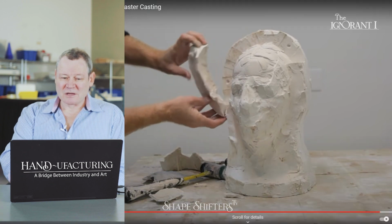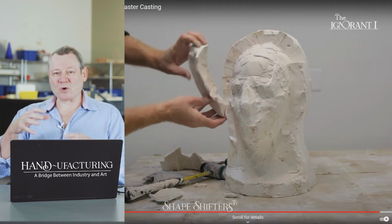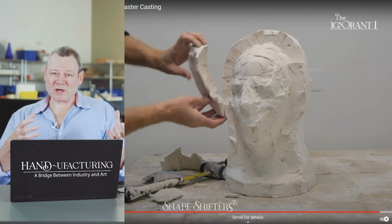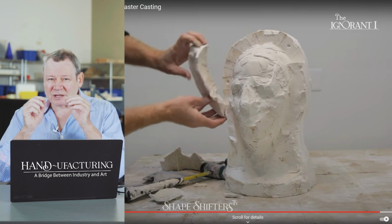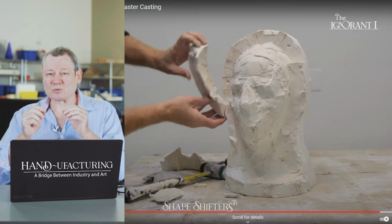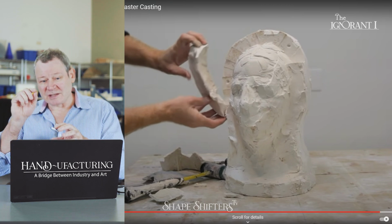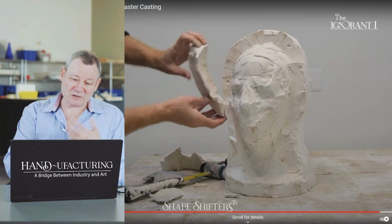Now, this is why I was saying that I would have put a little bit of pigment in the mold that I made. Now he's chipping off a white waste mold from a white casting, and he has an organic sculpture. So he's got to look and see what is mold and what is sculpture, whereas if the mold had been red with iron oxide, he could have just flicked off all the red pieces. That's my opinion.